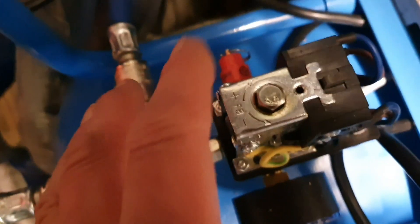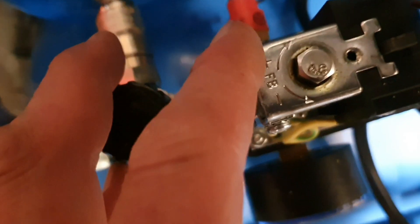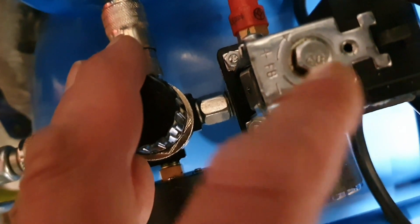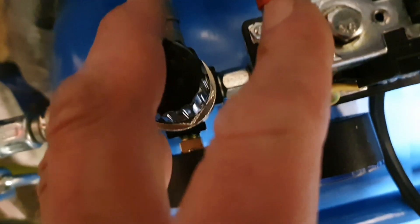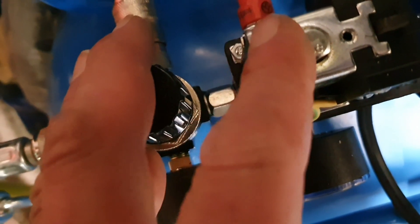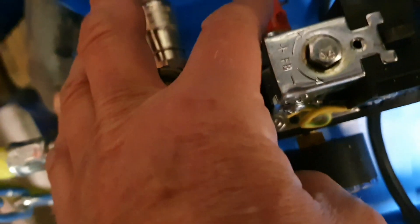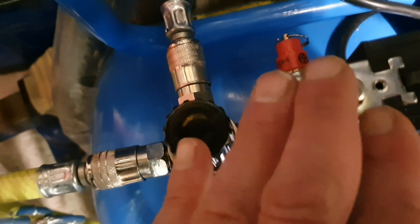That's why this cover was off. This is the third time I'm making this video, believe it or not. There's an adjusting screw here — you'll see it says minus and plus — and this nut here: you turn it either clockwise or counterclockwise to adjust the cutoff pressure of your vessel on your compressor. So if this is too high for the other one, this will keep running and this pressure relief valve won't cut out, but the other one will cut out.